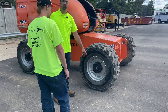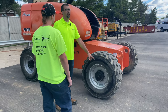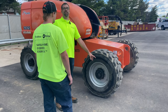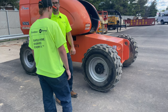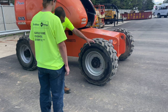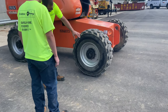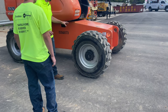Lug nuts — not very often an issue, but same thing: all lug nuts need to be on there. I'm not going to say you have to hand-torque it, but visual inspection — are lug nuts intact? This has oil behind it, so check for any oil inside the rim. No oil here — this tire looks good. JLG's guidelines say to treat foam-filled tires just like pneumatics. Work our way around the machine.